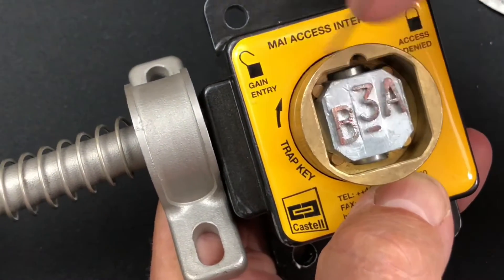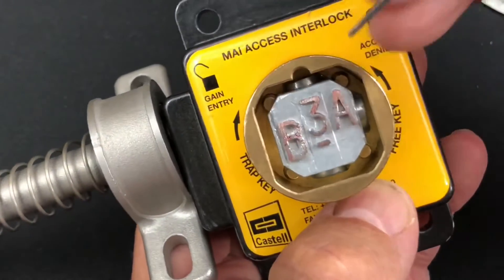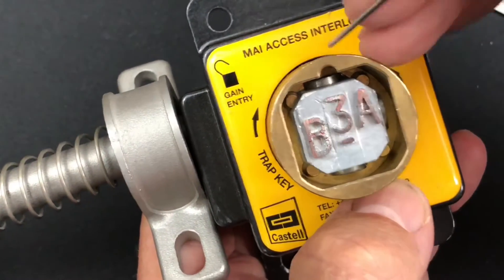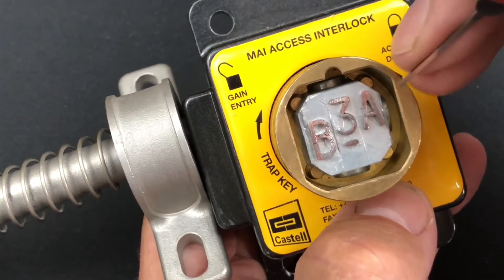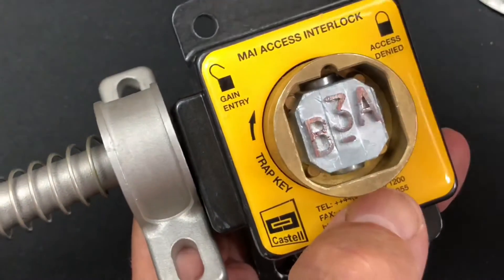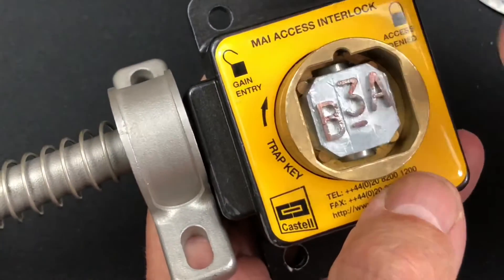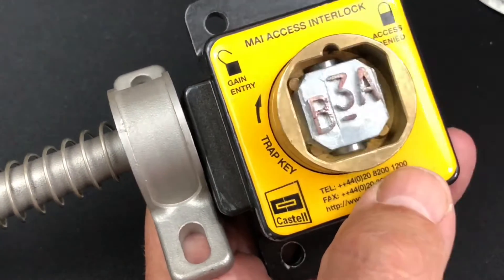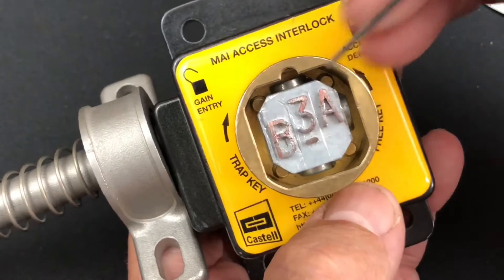Because the whole unit needs to rotate and these are tapered pins, they only bite for half a millimeter each time. So you'd go round and round in circles to actually get this open - you'd need to pick it probably about 40 times, with tiny little increments each time until it reaches the position that lets you open it up or energize the mechanical side. A very, very clever system using a very simple idea.